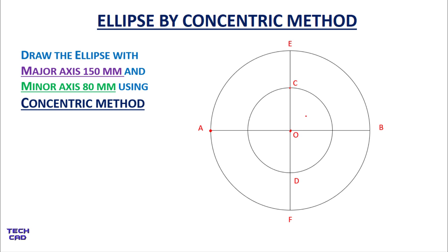Place your compass at point A and mark an arc. Then place it at point E and mark an arc. Then at point B, mark an arc, and again at point E, mark an arc. From all these intersections, draw vertical lines — first, second, third, and fourth arc. In this way you can divide the outer circle into 12 equal divisions.